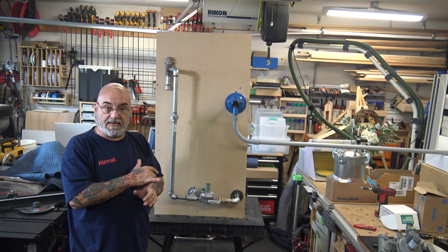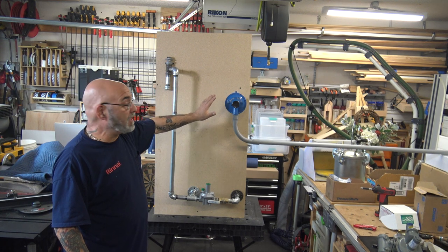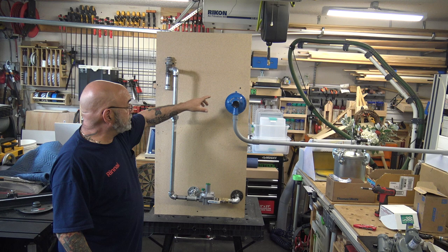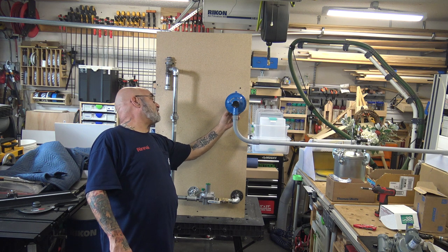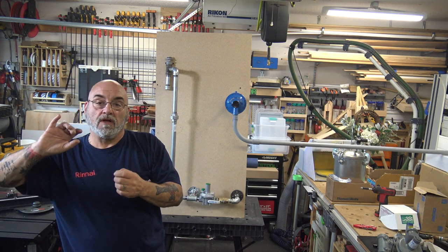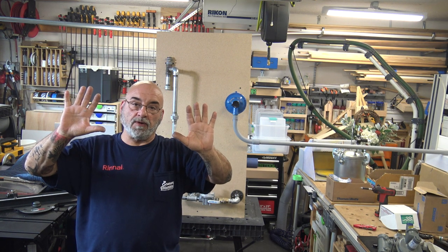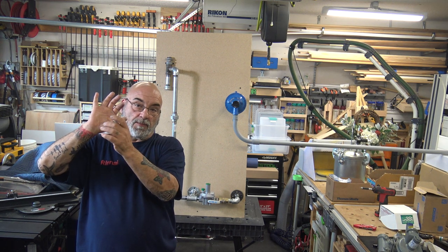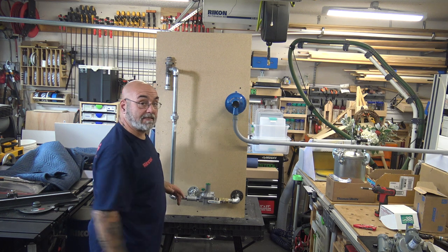We try to go at least 8 feet. And most of the time, it's the house, the regulator, the tankless. Because we always like to bring that regulator right near the tankless. We put a T right there, then go in the house, and then over to the tankless. There's some of these Rego regulators that actually have 2 quarter-inch caps, and there's an aluminum plate you can buy, and it comes with 2 copper or brass bolts, short, like 1/2 inch, and you bolt them in, and they got multiple holes, and you lag them into the wood so it holds this regulator nice and tight.